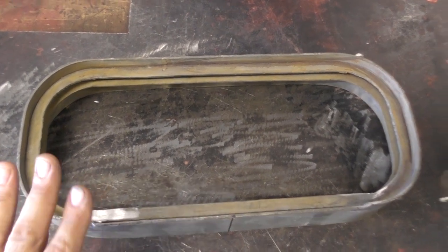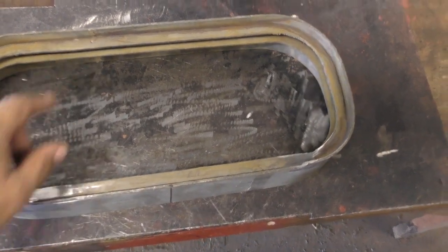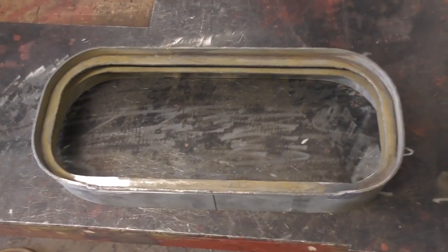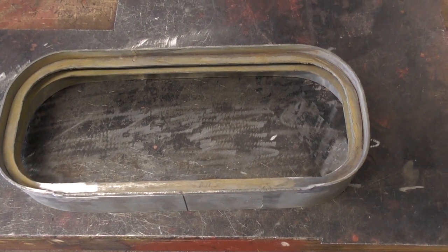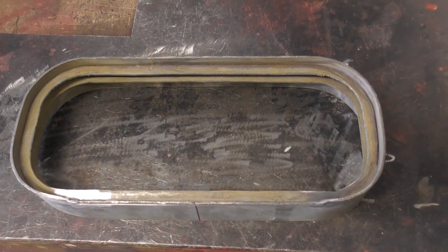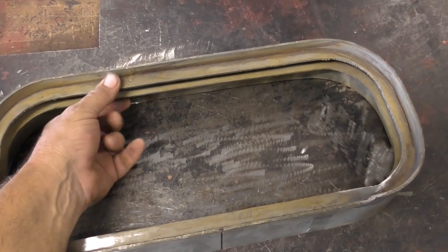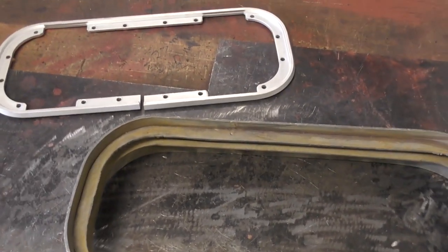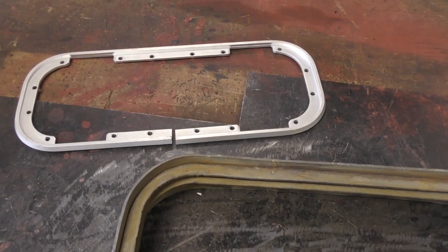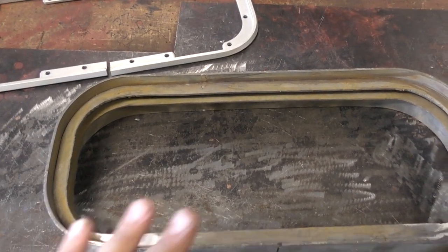This will become part of the cabin side. So that's the first part of it — why have I got these two rings? The simple answer is the design of the port light I'm using is really designed for fiberglass boats, and obviously the cabin sections of fiberglass boats are much thicker across this dimension. When I purchased these port lights, I knew they were not designed to go through the skinny steel plate of a steel boat.